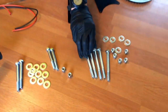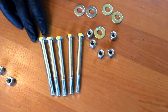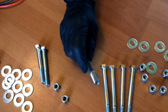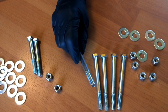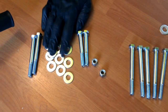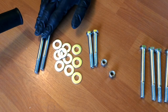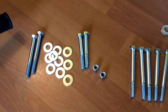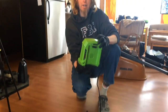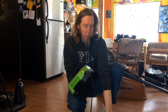The additional stuff you have to buy yourself: you need five bolts for the front wheel that are at least four inches long — I use three-eighths inch bolts, but different sizes work as long as the bolt width fits through the eyes on your chainring. You'll also need washers for spacing, a couple of bolts that are three to three-and-a-half inches with nylon lock nuts to mount the bracket to the wheelbarrow, and a charging unit for whatever battery you're using.